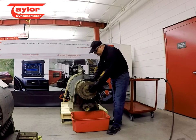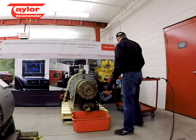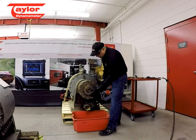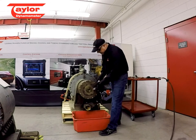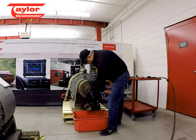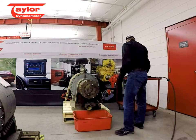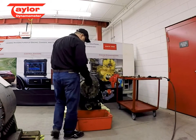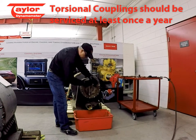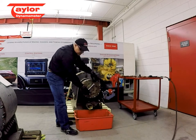What I've done here is back the nut off enough to where it protrudes about a quarter inch beyond the drive plate of this coupling. I've got an old tool here that actually bolts up to where the drive shaft would normally bolt up, and what it does is it bridges across this nut — that's why we have the nut out about a quarter inch. We're going to thread this on. This is a special tool you can probably make up and have available, because these couplings should be serviced at least once a year, and it's an important part of your system. You can use an impact on this if you want, as long as you have enough thread engagement.